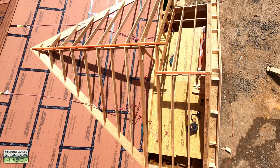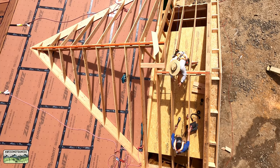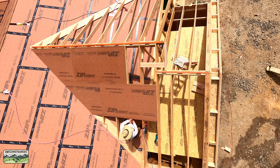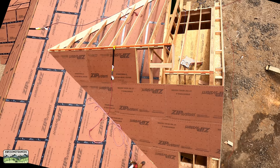You're going to have to rewatch this a few times — and trust me, I have to go through this each time too. That's the basic math. Now that we're ready to sheet this roof: I still have to cut the lookout and finish the gable-end trim first. For these roofs I like to sheet from the top down, because I can walk on that 5/12 for the majority of the roof. I snap a line 49 inches down from the top — that gives me a one-inch air gap. Kyle already knows the valley sheathing angle from BuildCalc, and I can give him one number as we work our way down.